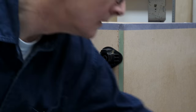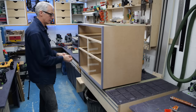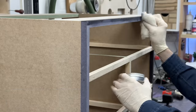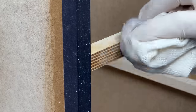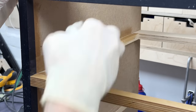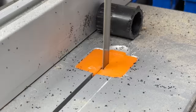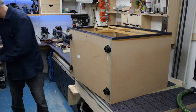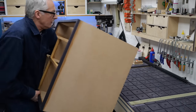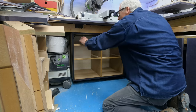I'm using kitchen cabinet-style adjustable feet so that I can get the cabinet in under the bench then raise it up to lock it in place — the leg sockets are just screwed on. Once that's done it's time for a coat of finish on all that edging. I'm using a carnauba wax from Leo at the Hand-I-Craft channel — thanks Leo, and yes I have been pronouncing it wrong all those years. The wax goes on very well with a stockinette cloth both on the fibre colour lipping and the birch ply trim. The legs are cut down on the bandsaw, pushed home into the sockets, and the cabinet slid under the bench for a snug fit, then the legs wound out so the cabinet locks in place.